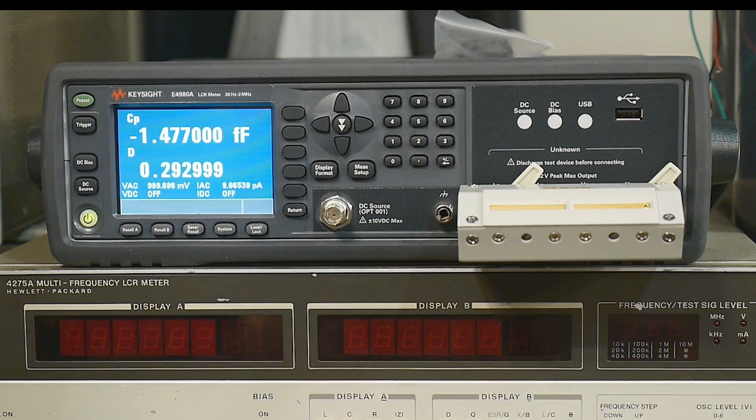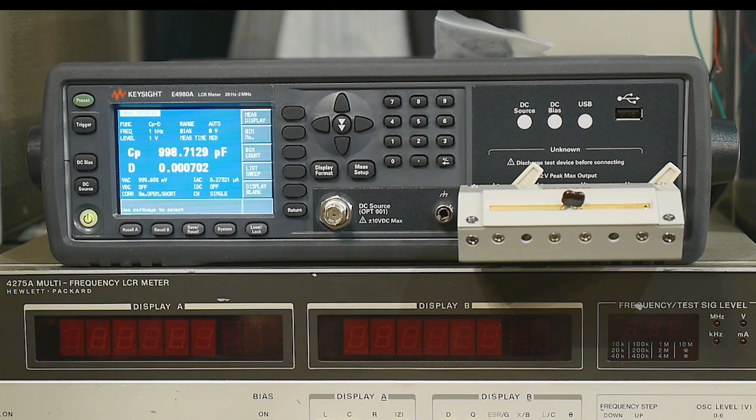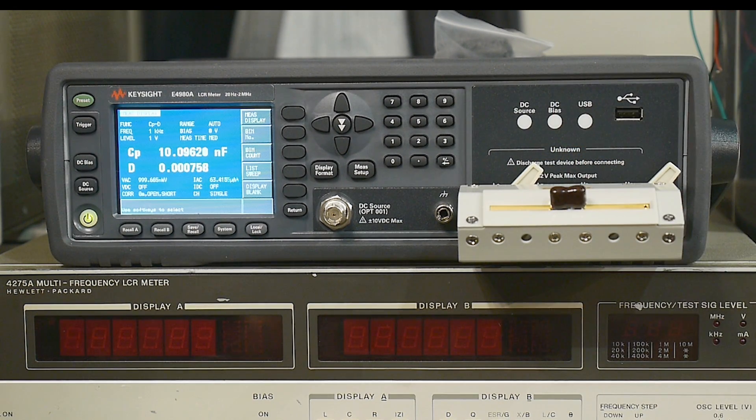Let it settle down. There's still a lot of noise between femtoamps and femtofarads and attofarads — just words I have never said before. Let's go ahead and pop in a device. This is a 1,000 pF capacitor — that's what it's measuring. Currently we are measuring at 1 kilohertz. We can pop in a different device — this one is 10 nanofarads. Look at the accuracy: five digits after the decimal place. That's absolute nuts.